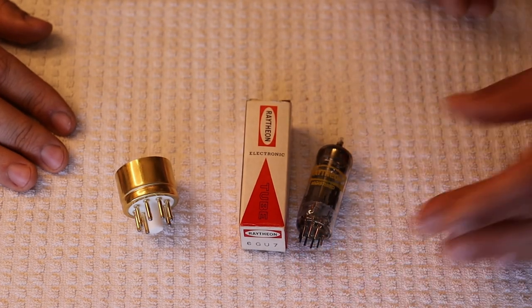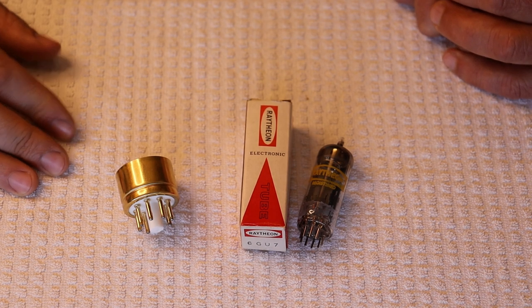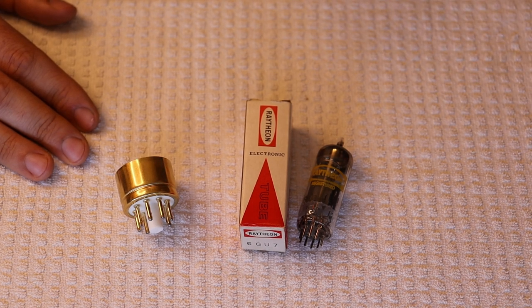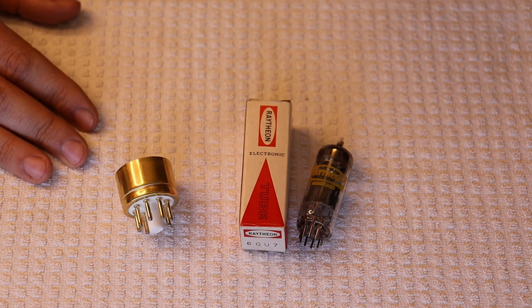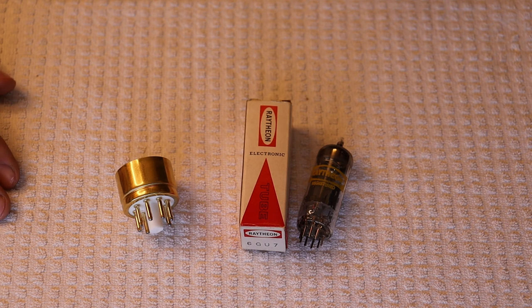I mean, we put it into our universal 6 or 12SN7 kit preamp, and it sounds like a completely different unit. The topology underneath that's allowing that sound to come out is still the same. We still have a dual mono circuit, a very quiet circuit, and lots of reserve current capability in the larger than necessary transformer. All those things are underlying the tube and supporting it, but ultimately when you plug in that tube, you really have a different preamp. That's fun. You don't get that option in solid state equipment. You've got to buy yet another preamp.